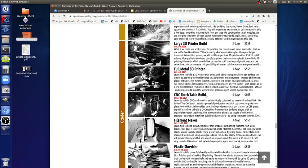In terms of difficulty level, a CNC torch table is a torch on a CNC gantry. If we get the CNC gantry, we've got the torch. So if in the next day or two we master the axes, and there are some issues, for example yesterday one of the Z motors, the pulley is not on, it's just slipping. So whoever did that, we got to do the two. It's a better question of who didn't do it, because it wasn't on tight. The procedure there is to get the two set screws on tight.